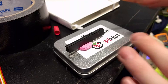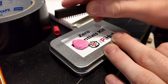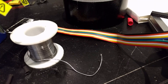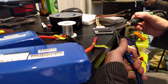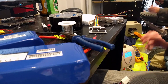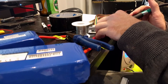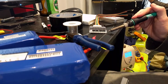Because the last thing you want when building an electric scooter is to have it catching fire under your feet while you're tearing down the road at 40 k's an hour. We're going to use standard headers because they fit nicely into the balance connectors on the battery, so we don't have to chop them off and it keeps things versatile. I've just invented a little jig using blue tack and a female header to hold things up nice and straight for soldering. It can be tough working with high current applications — everything has big fat wire and that means everything acts as a heat sink, so you need a very good soldering iron with lots of power.